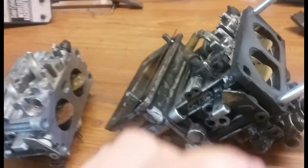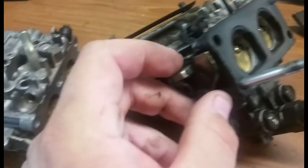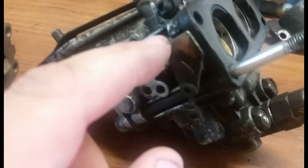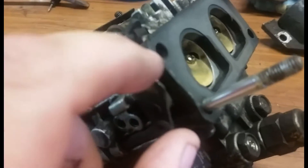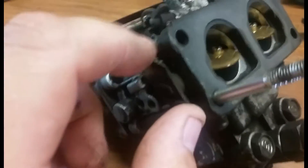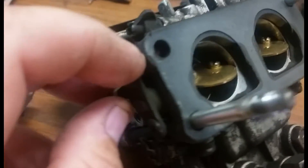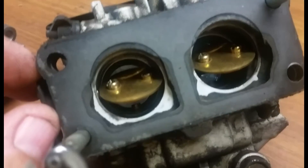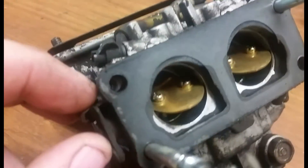This is on a John Deere 737 Z-Track mower, and the thing you're going to have to modify is the throttle stop right here. Those are your throttle butterflies. On this 23 horsepower engine, whenever you're at full throttle, you can see it's hitting the stop — the throttle butterflies are only about two-thirds of the way open. They're not all the way open, so they restrict horsepower by restricting airflow.